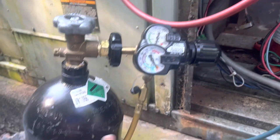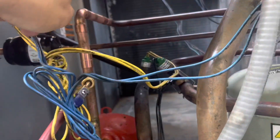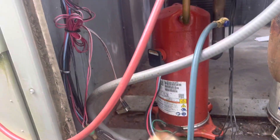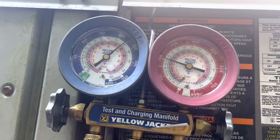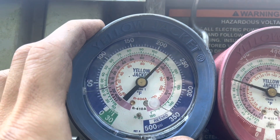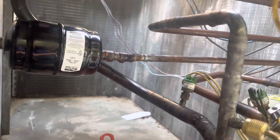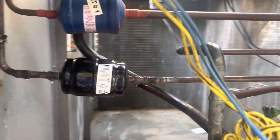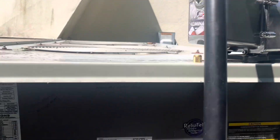Got the nitrogen set to braze. Nitrogen goes from the tank through the red hose, through all those fittings, through the dryer, and comes right back out the blue side. Now we begin soldering. I finished with the solder — next is the nitrogen test. Got it set at right under 220-225 PSI. We got everything soldered in and I'm going to do a bubble test.